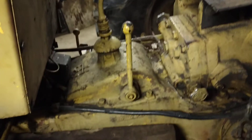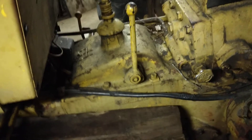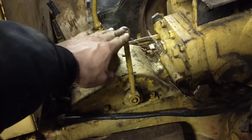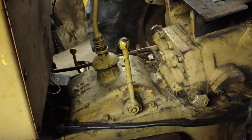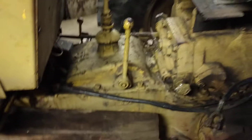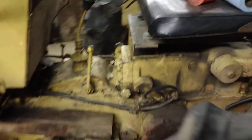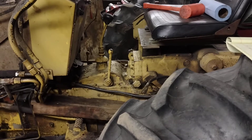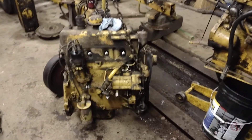After that, the next project will be to pull this cover off and look at the high/low. We have an issue — it's stuck in high, won't shift. You can shift to low but it does not work. In the process of the owner trying to free up the clutch, he damaged something internally — I think probably just the shift fork, but we'll see once we get into that. I'll update you guys when I have more — thank you for watching.